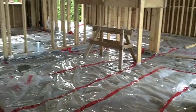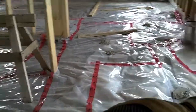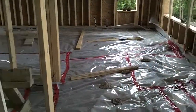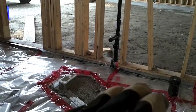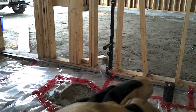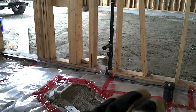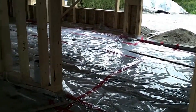We're now going to get an inspection on our floor. And the last thing that I'm doing today is I'm actually running acoustical seal — you can see that black line that runs all the way around the house. It's a really goopy stuff that doesn't come off your clothes very well. When the concrete pushes up against that line, it actually squishes and creates a vapor barrier and an actual seal between the foundation and the slab. So we're going to be ready for the slab as soon as our inspection passes.